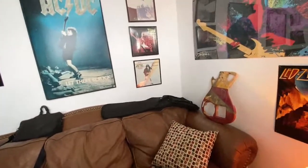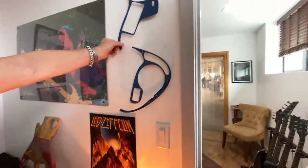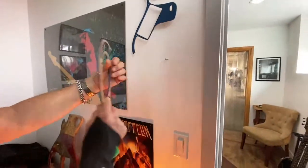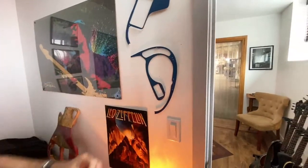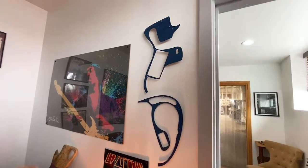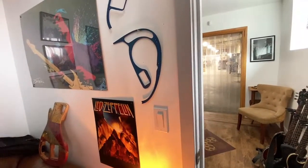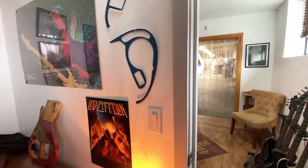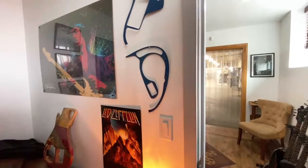Wow, awesome. This was from one of our first attempts. We built the original one out of layers, each one this thick. We were with Grover Jackson, and he helped us. He said, I'm not going to design it for you, so just slice up your design and we'll cut each layer by itself. So we cut 18 layers on MDF and glued it together, and it just warped badly.